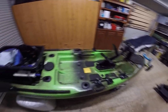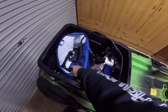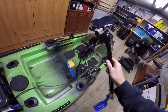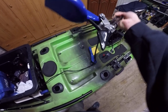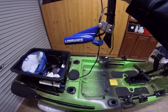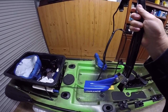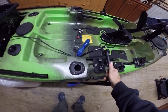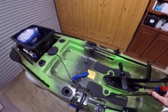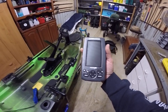So in the box - my everything box. You see at the front I have my battery for the fish finder in there. Here's my transducer - it's made out of about 15mm PVC and I've painted it black. On the end I heated it up and squashed it, melted it together to make it all watertight. I've cut it on an angle, and also made it a little bit longer than where the transducer comes down. That way if I go over any stumps or hit anything, it'll hit the PVC rather than the transducer. This just simply pushes in the side like that. All the spare cord for the fish finder goes underneath. The fish finder I use is a Lowrance Hook 4 with chirp - great little fish finder.